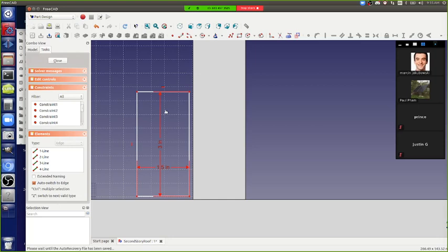1 inch would be nice, but what's an issue with 1 inch? What do you think? You guys have experience with some of this. It's hard to cut. Hard to cut? Not hard to cut, because you can cut it off a long board of a 2x12. Okay. You can cut 1 inch. When I'm placing it, it's not just going to stay in place if I wiggle it too much. You're using a speed square. You're going to get it straight vertically up.